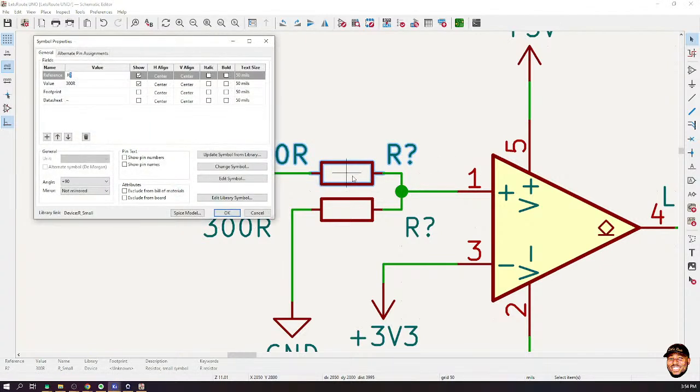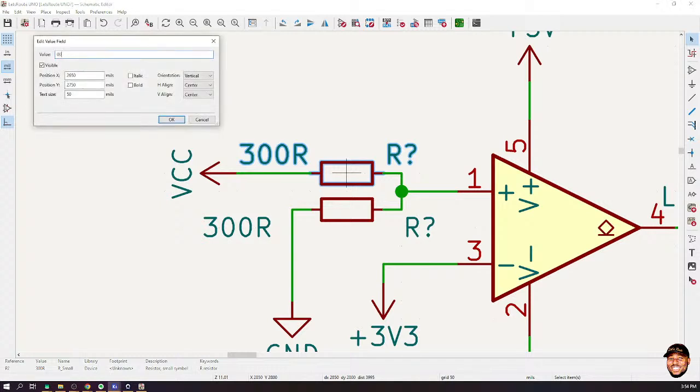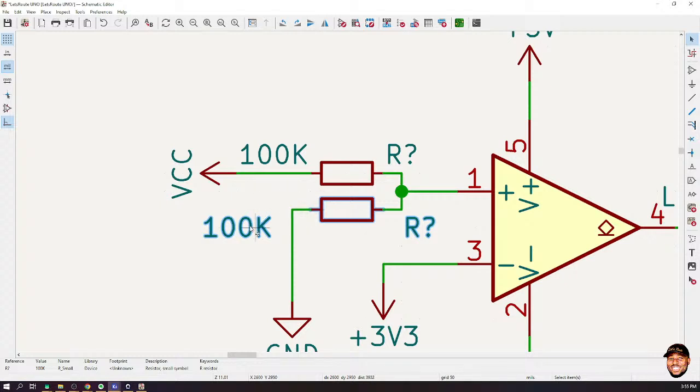So I'm going to choose a very high resistance for this, let's say 100K. This is to ensure that very little current is flowing. Technically, this is an open, current is not supposed to flow, but of course, that's an ideal situation. Then I'll choose another 100K over here. Choosing 100K just means that we are always going to have a voltage at this point higher than this, so far as this is connected. But to use the VCC, you actually need to connect something from 7 volts upwards.